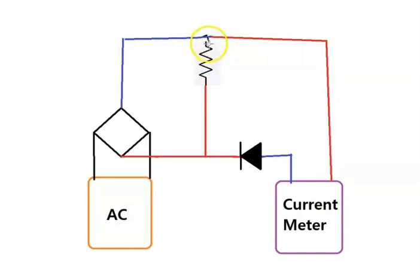At that point there's a split. This current is going to go left because it needs to return to the source — it needs to complete the circuit. If it goes right, it goes through the current meter, through the diode, and back to the positive where a diode's blocking it. There's no completed path there. So the current coming out of this AC supply must go up through the resistor, back through the blue, back through the diodes, and into the other side of the supply. That's the first test — you will see zero current flowing through the meter with this configuration.